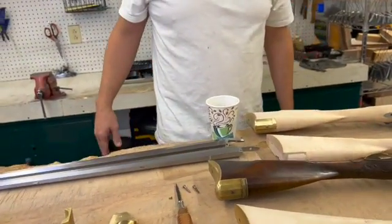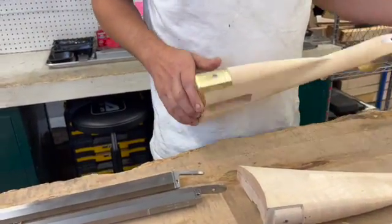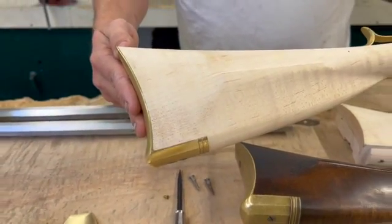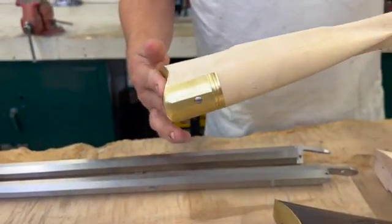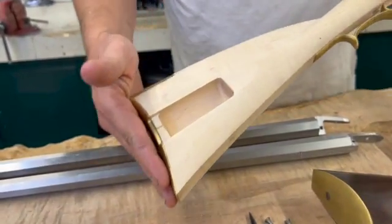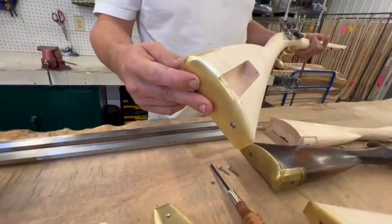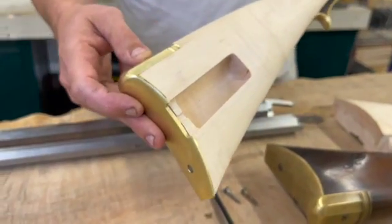Here's one on the gun. The neat thing about these is that they fit very close right out of the box. You can see the fit is pretty darn good, and that's really without any wood removal at all. That's the big advantage of why we decided to machine these — we want to make this kit go together as easy as possible and be as nice as possible, and it's just hard to do with the cast butt plate. Even things like fitting the box to the cutout in the brass — this one isn't completed yet, it's still rounded — there's a little work to do with the program, but that'll be a hundred percent cut out. It just makes the whole assembly process so much easier.